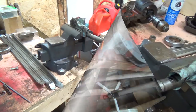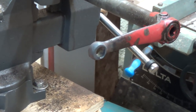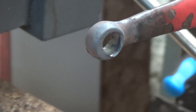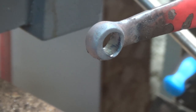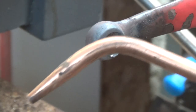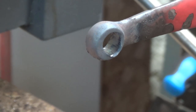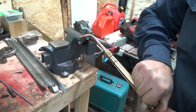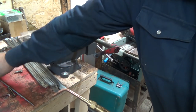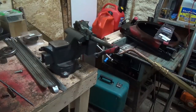I've got the inside cleaned out with a chainsaw file, and I'll see if we can add a little bit of braze to the bottom in here and see if that's going to help at all. I've got my goggles, the small tip on the torch, so we'll fire it up and we'll see if we can braze a little bit into there. Better not let the bench on fire.